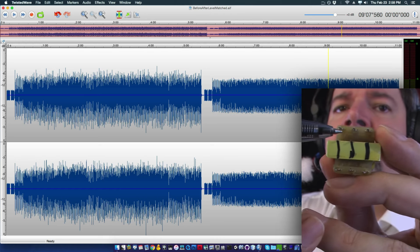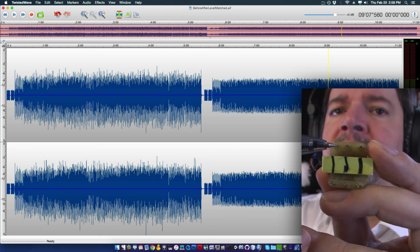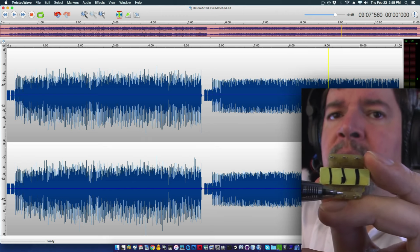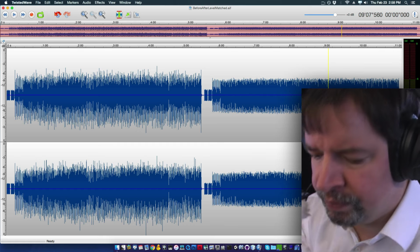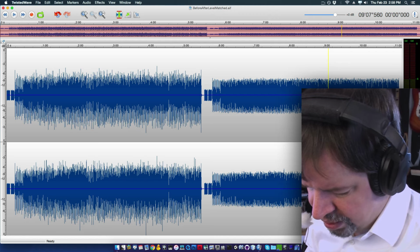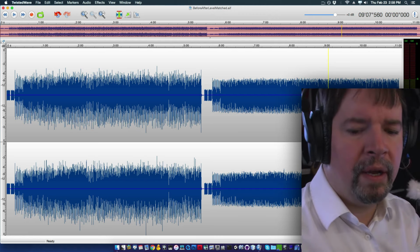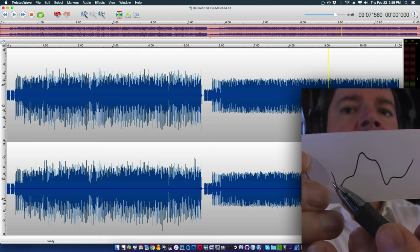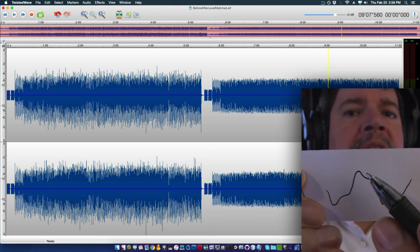And my diode is going across. So the diode is going from the end of this transformer coupling to the beginning of this transformer coupling, which is also inverted because it's the other side of the channel, and vice versa. It's this little crossover-y thing. And it would do this crazy thing. It would do this. I'm not sure what orientation I'm going to be using, but it would start here and give me a big peak and then cut it right back, and then swing over to another peak and then cut that right back.